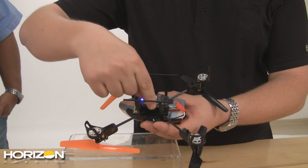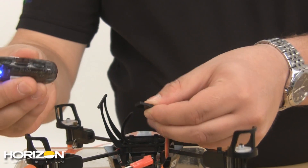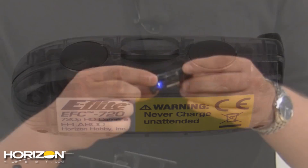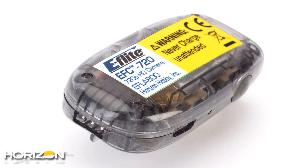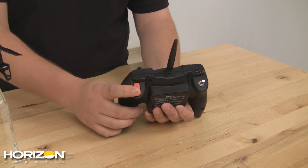The camera attaches at the bottom with a hook-and-loop strap — easy on and easy off — and it's also connected by a servo lead. The camera is very small. It's got an on/off button, a stop-and-start button, and a mode change button. The EFC 720 can do video and also take photos. The servo lead allows the transmitter to control those functions while you're flying. You physically have to turn the camera on before flying, but once in the air you can stop and start video, take photos, and switch between modes. Holding the trigger for four seconds switches modes; pressing it once stops and starts video or takes a picture.